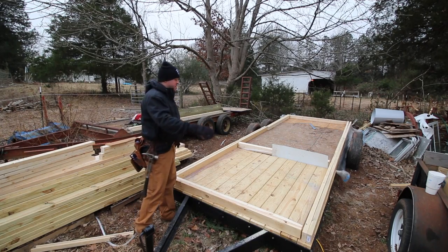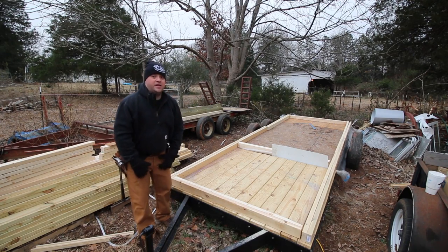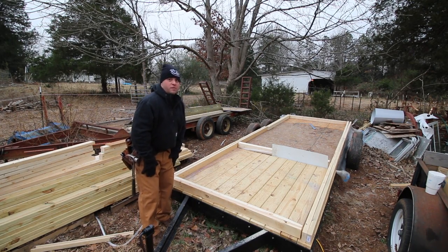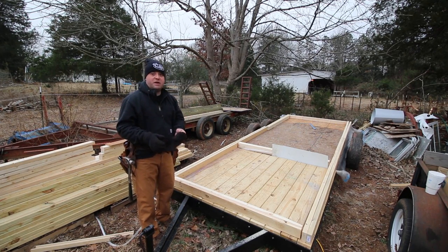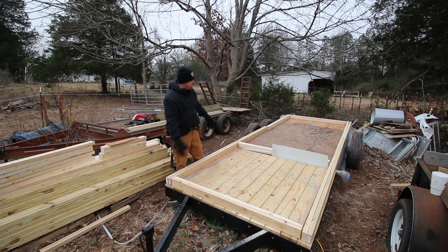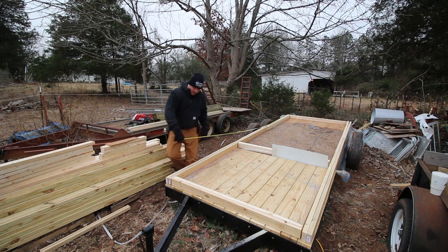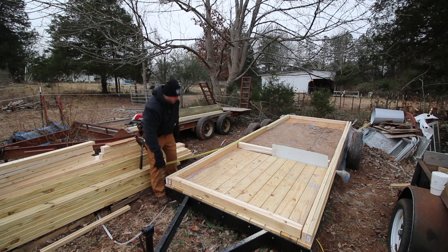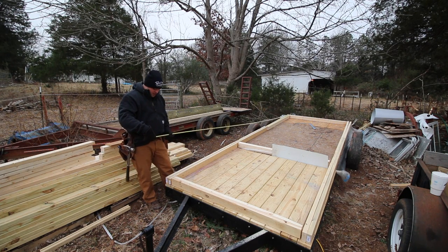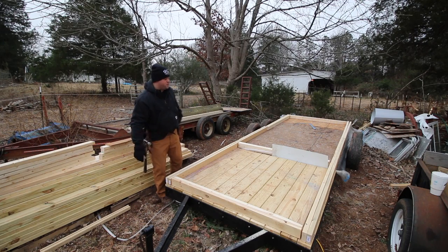You can see here I finished the plates — totally new day. The other day it was freezing cold; today it's equally freezing cold. I've got three five-foot walls that'll go in between these two long walls. How long are they? It should be like 16 feet, right? 15 foot 11 and a quarter, plus a half inch on each end, so 16 foot 1 and a quarter. It's going to be a little longer than that with overhangs and roof stuff that I'm going to be doing.